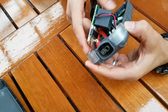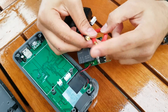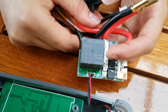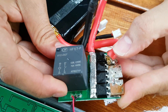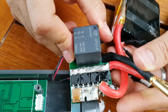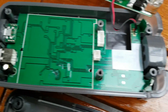Looking at the other circuitry, there's a nice design — these are the plugs that go straight in for the alligator clip connections. There's a big relay here, 70 amp rated, 14 volt DC with a 12 volt coil. And looking at these components, it looks like a bridge — the part number is PFC RFP 40L450. That's coming straight from the battery, and that smart piece tells the relay whether to connect the battery or not.